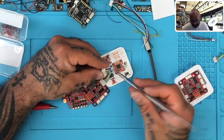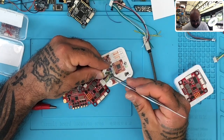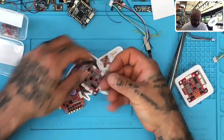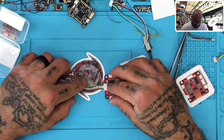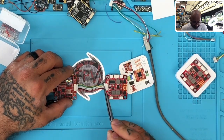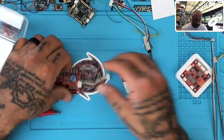All this hassle because they're not staying consistent with the way they do their wiring — and it's not just this company, it's a lot of them. So now we have inverted and swapped the cables. Now when we plug it in, you can see the yellow cable is switched over — it's the second-to-last here but the last here. So now we do have current to current, TX here to RX here. So even when you get the same manufacturer, the way the harnesses are done doesn't necessarily line up right.